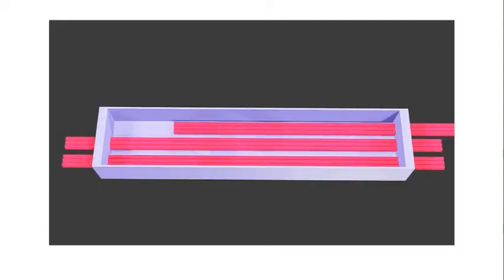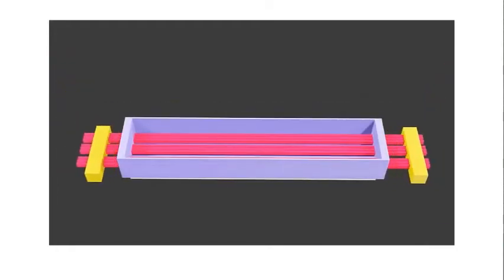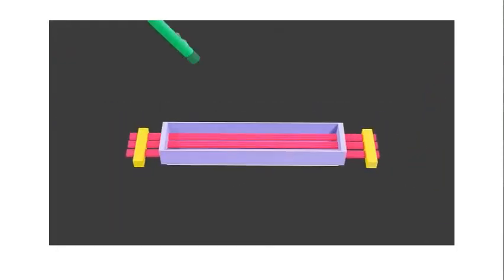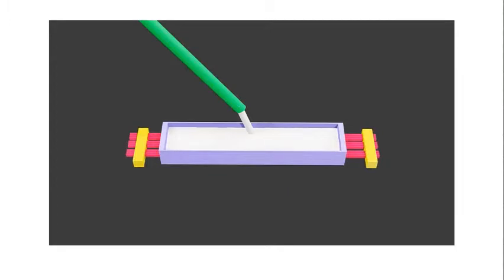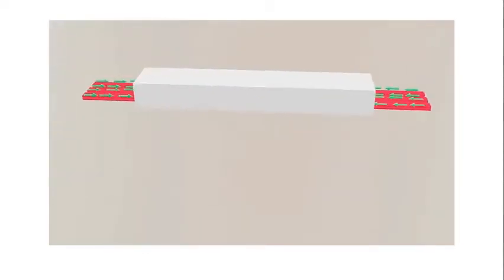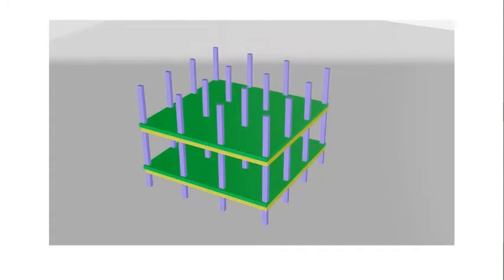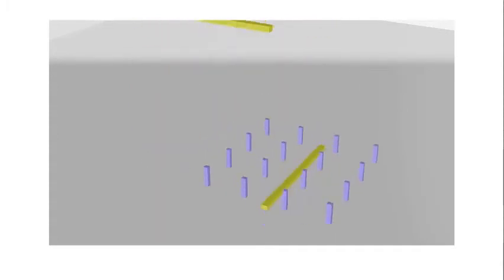In pre-tensioned concrete, firstly steel wires are pulled, which will further act to produce compressive stress. After stretching the steel wires, concreting is done. When the concrete achieves its characteristic strength, the grip on the steel wires is removed. As we remove the wire grip, it tries to compress the concrete, which produces compressive stress in the bottom of the beam.